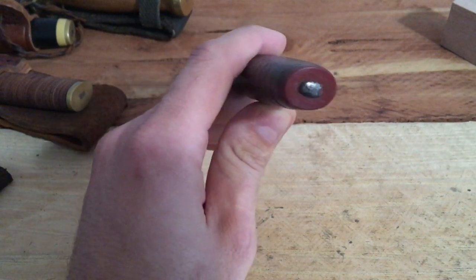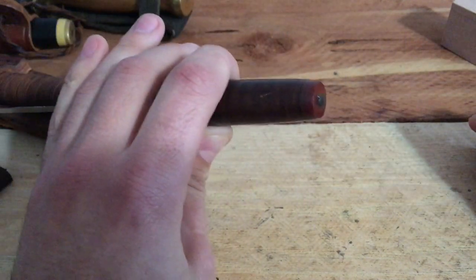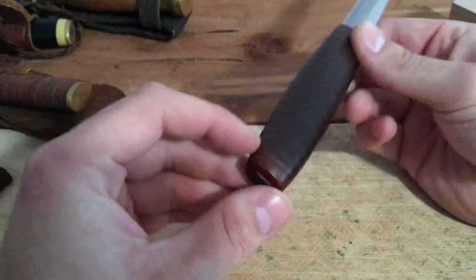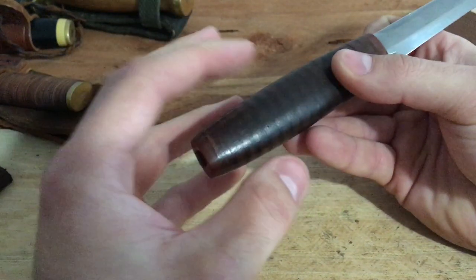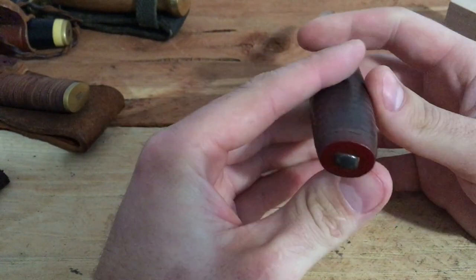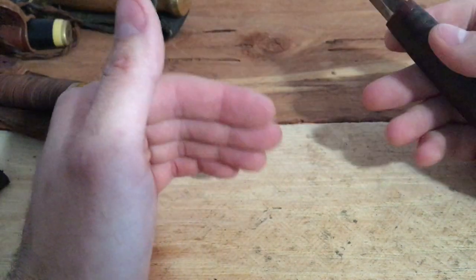This is just a utility grade knife, and it's a very strong and simple way to make a handle. You don't need a counter bore — it simply sticks out the end just a little bit. You want to have the handle sections compressed nicely first, and then as you peen the tang over it tightens up like a clamp, just like a rivet. It's less aesthetically pleasing, but it works and it's very simple to do.